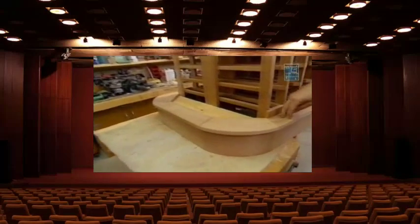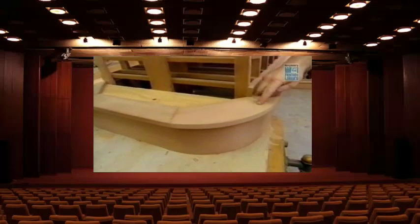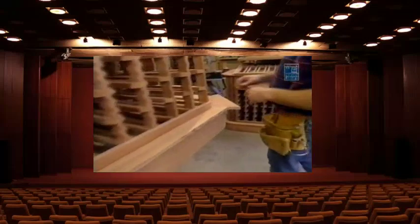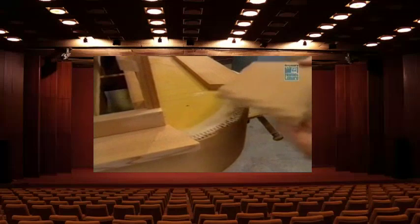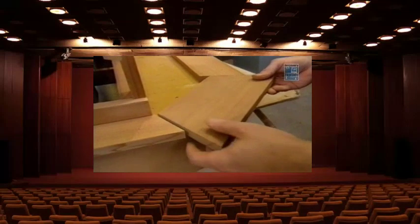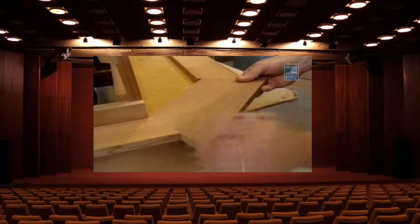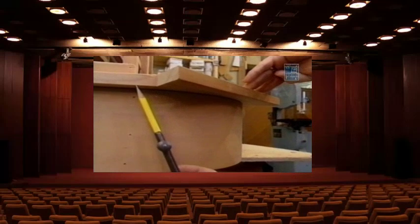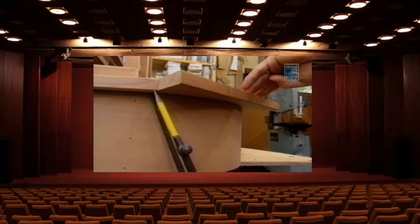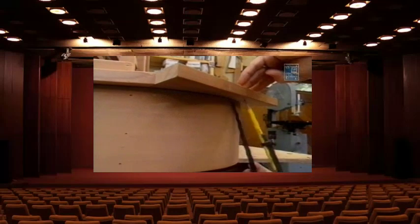There are straight pieces on each side and a curved piece that fills in the corner. The only tricky part is the curved piece. The side pieces have been cut at 22 and a half degrees, and a five-inch wide piece has also been cut on each end at 22 and a half degrees to fit tightly. To lay out the curve I'm using a pair of dividers set to the overhang of the straight portion and trace a line on the bottom of the wide piece.